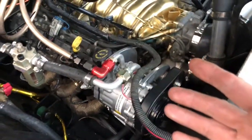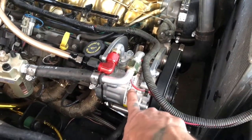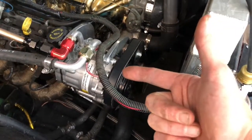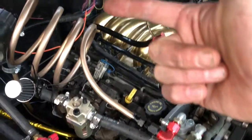Then you need a longer belt. You're going to have an input, an output, and a power wire. The power wire, depending on your compressor, is either going to need power to activate the clutch or power to disengage the clutch. Most times it's power to activate the clutch. You're going to have a relay inside.